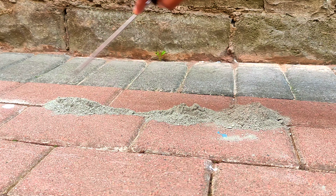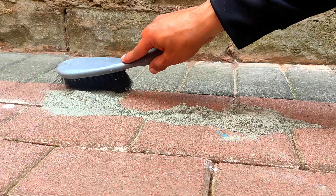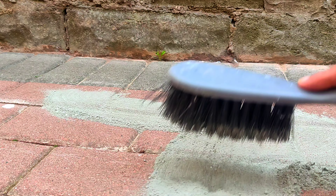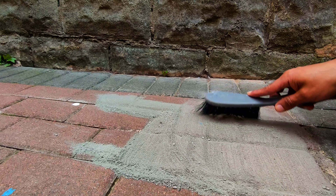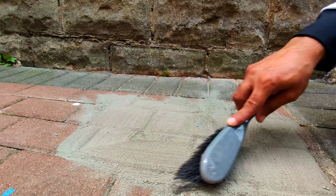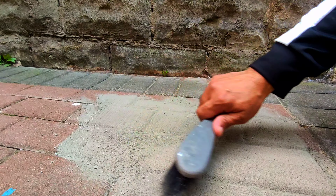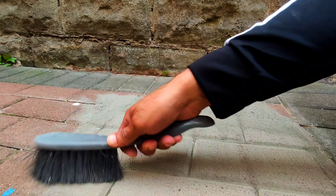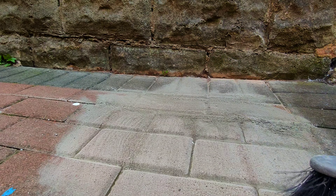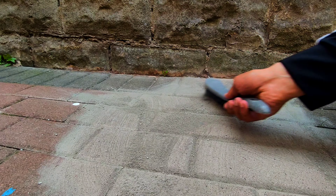I'm going straight in and putting cement on top of the block paving — obviously this is going to discolor the blocks, so are you prepared for that? Are you happy for your blocks to be discolored? That's up to you. I did notice a slight discoloration, however when it rained and water was added it was still able to sink through, which made me believe the cement is not thick enough to create a waterproof membrane. The blocks are a little bit more hazy now — that pinkish-red color is slightly changed. Is that acceptable? That's something you need to think about.